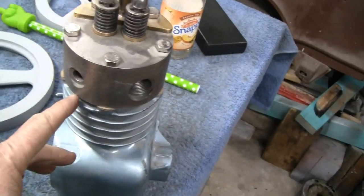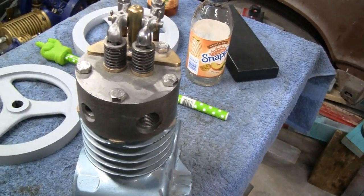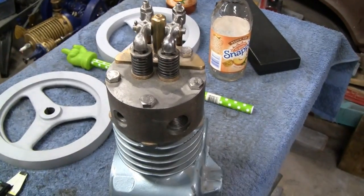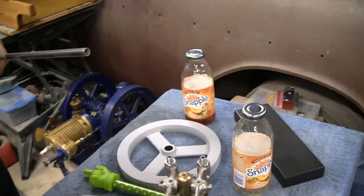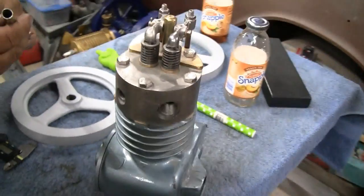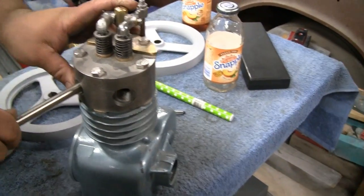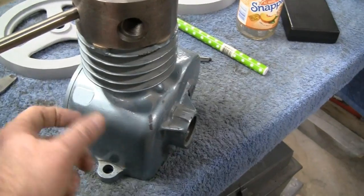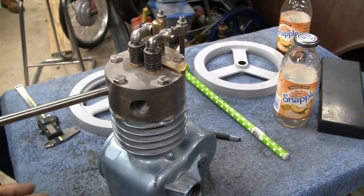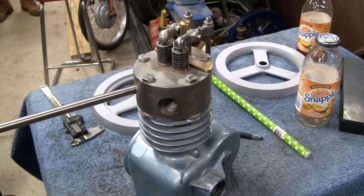I think other than that, all we got to do is try and figure out how we're gonna route the fuel system in the side here. Did we already do the? Yeah, that's done. Oh, there it is. Grab that pipe, because that's the pipe we're gonna use. I was going to use brass, but I couldn't get it thin enough, and this stainless here, the wall's a little thinner. Right, that's the side cover. So that's a stainless tube there. It'll go in there. It has to bend down and then over. It's got to make maybe a compound bend, and then the carburetor is going to mount right in this area, and then the exhaust is going to come out this way. So that's a good fit.